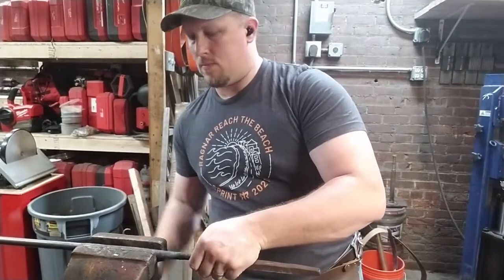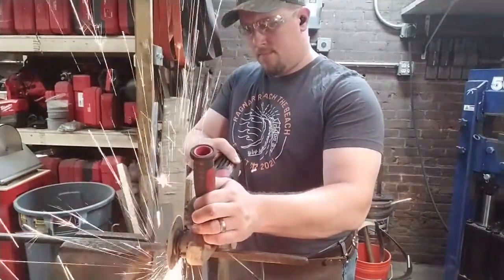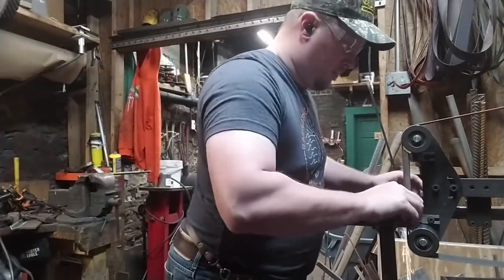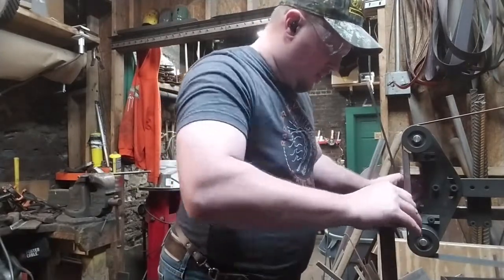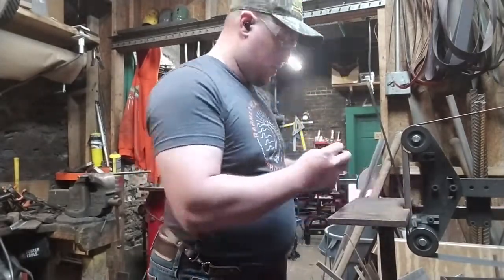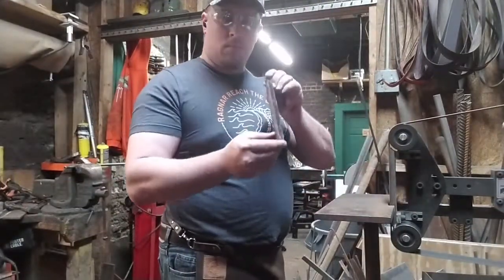If we had proceeded straight on to welding up the billets from the bars that we made last week, that fold would have been perfect, but as it is, it's had a week to sit and oxidize, and we're going to have to improve the surface, and that's what we're going to start doing right now. Now, there's a couple of times where I'm going to hold the bars to the camera and show you the surface finish, and what I'm trying to do is show the visible layering to the camera, but I'm afraid that wasn't picked up very well by the camera. But the layers in the steel are very visible to the naked eye.